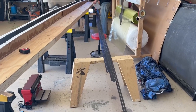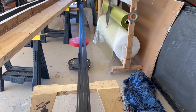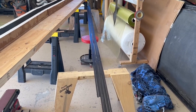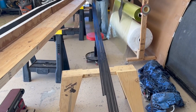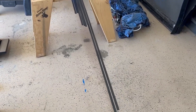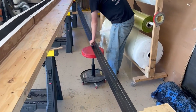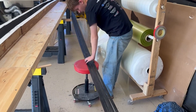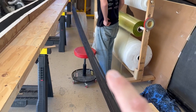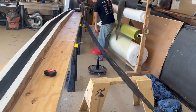We're getting started with the first course here. Ryan has the cut list there so he's arranging them in order. We're about halfway through the upper and lower first course of spar caps — this spar gets a ton of these half-inch by eighth-inch thick pieces. We're gonna have a little contest of who can guess how many feet of carbon in this upper and lower total spar.